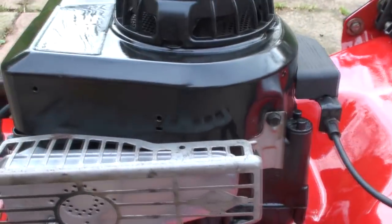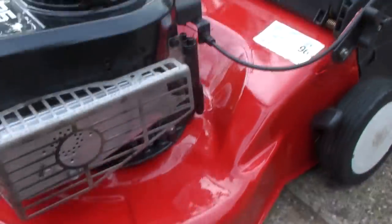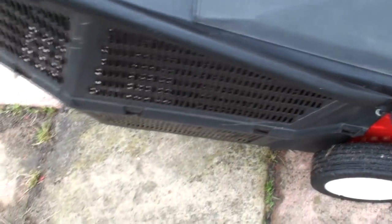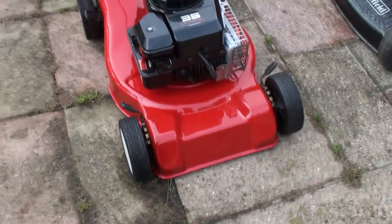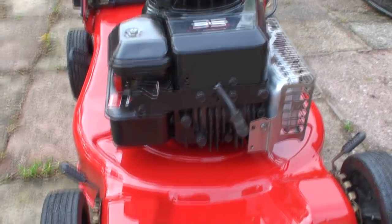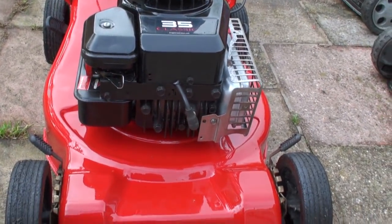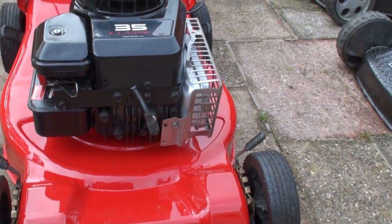We've actually transformed this into a full working mower now, and I'm sure you'll agree that it looks a hundred times better than what it did. I painted the exhaust with a heat resistant paint, the casings have just been painted with a black gloss paint, and the deck's been protected with a 2k lacquer. It looks absolutely superb compared to what it was — it looks like a usable mower. The handles are sprayed with a satin black paint and everything looks like a very well-maintained mower. All that's left to do is start it up and burn off that original oil left in there, because the exhaust would have filled up with oil, and after about five or ten minutes when the oil clears we'll have a perfectly running mower. Most people when they get a smoking mower like this think the engine's worn, but that's not the case.